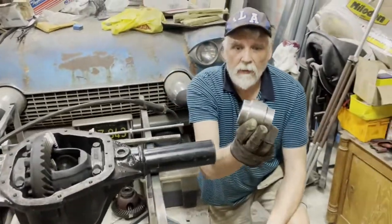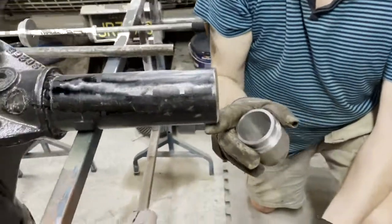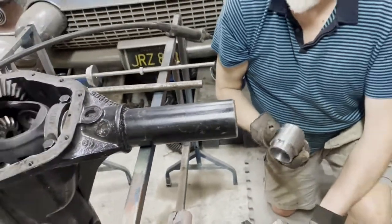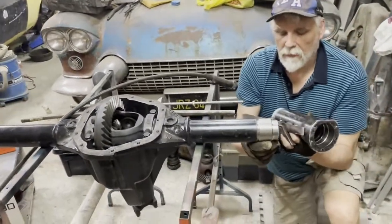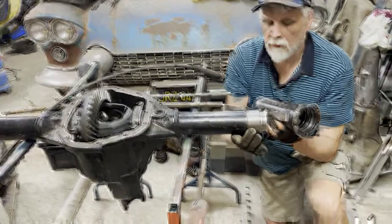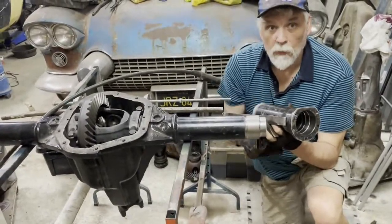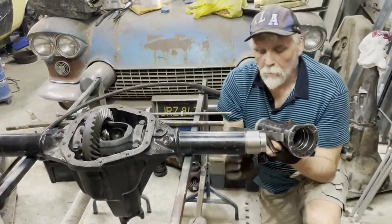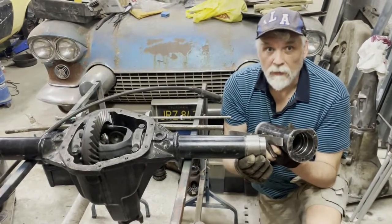What you see here is a 45-degree angle up here where the weld will be, and I have also ground off a 45-degree angle here — that's where we will have the room for the weld. We will first start with some weld to keep this together, then a bottom weld with the MIG, and then I will use a stick welder to do the proper weld on top of the MIG weld.